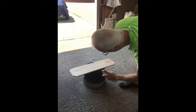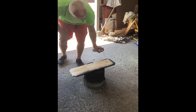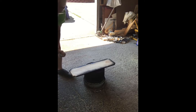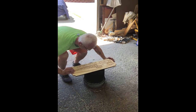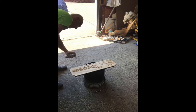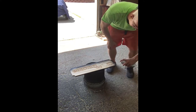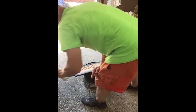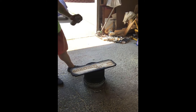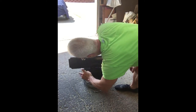Now I'm getting ready to spray the black. I use a flat black spray primer — I think it's Krylon black primer. I'm doing the back and the chamfer, then I'll spin it over and do the front along the edging. I try not to get too much on there — I don't want to over-spray because it's just more that I have to sand off, and it can bleed through. This is pine and I've already applied sanding sealer to help prevent bleeding, but if you put too much you can still have bleeding, so I try to go light.